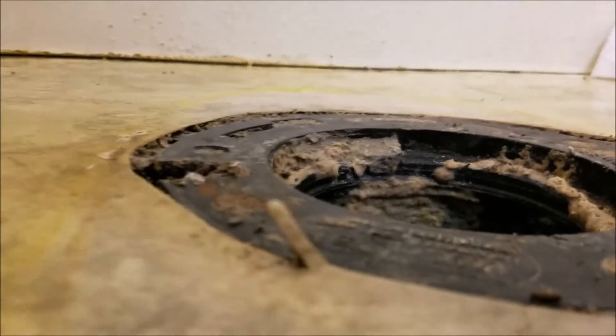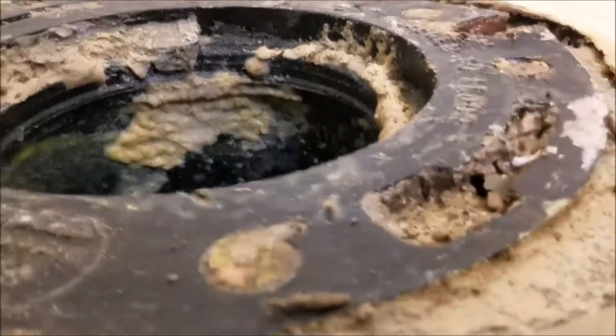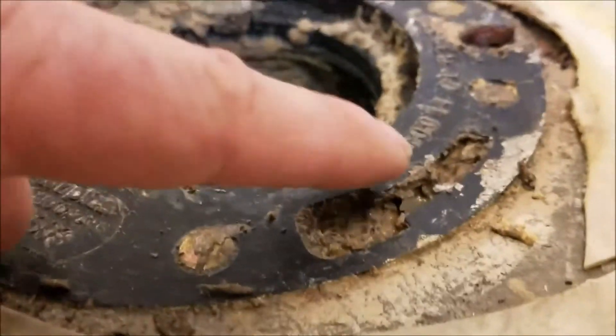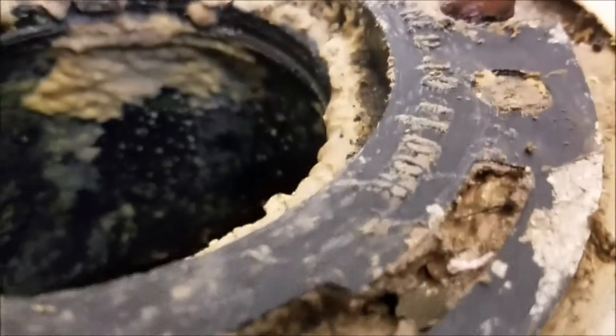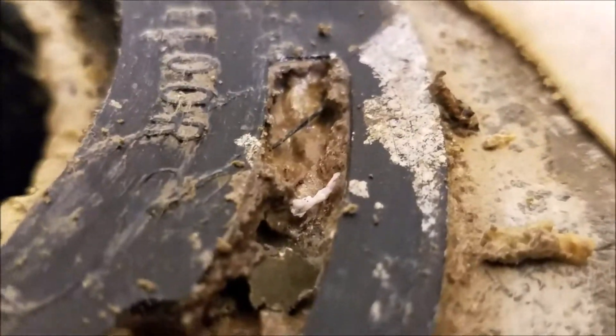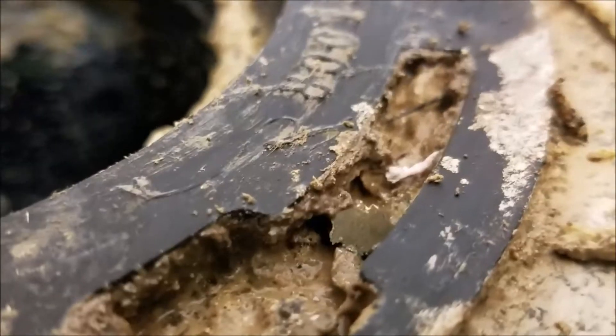We do want to take a little video — it's nice that they have an ABS flange here. They started making these flanges adjustable, so you can see this big slotted area. What they would do is take these two slotted areas here and here and spin it to the sides. That allowed the plumber to slide the side bolt on there and adjust it back and forth. The reason they did this is so if the toilet sets crooked off the back wall they can correct it. I don't like them — when they cut so much material out, it leaves the outer lip very fragile and it breaks. A lot of times when it's mounted over here you get these bolts in there, it gets over-tightened, and eventually it snaps and then you're in trouble.